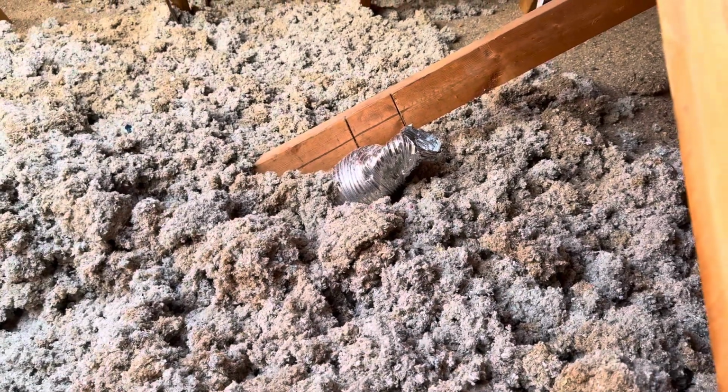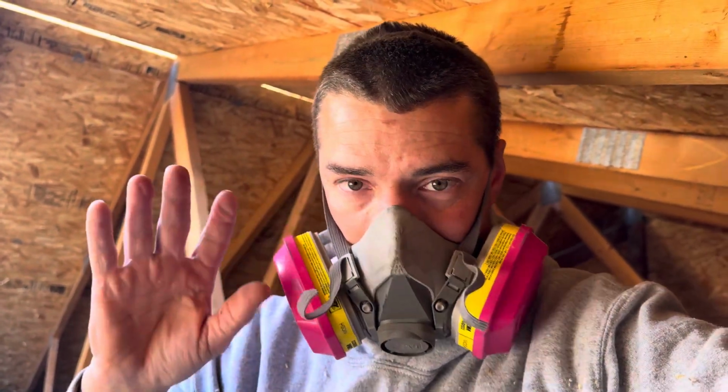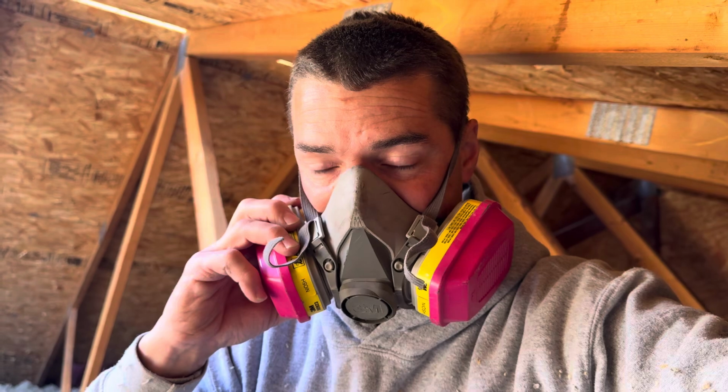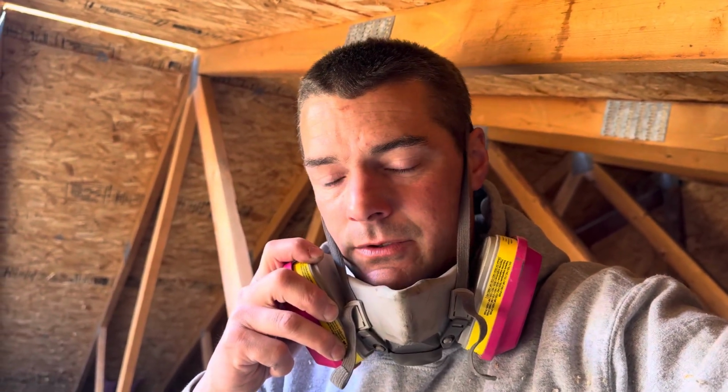You don't want to run a very long span for several reasons. If your span is really long, it's putting too much deadhead pressure on there. It doesn't matter in fluid dynamics whether it's air, oil, whatever the case may be. If you're pushing something a long distance, it's not going to be efficient. So you want to keep it as short a span as possible. The second reason is the temperature change from outside in the cold wintertime versus the inside shower, moist, damp air blowing. It's going to condensate. So those 2 things, you don't want that moisture in your attic. You don't want to just dump it into the insulation or blow wherever. It's not going to run efficient.